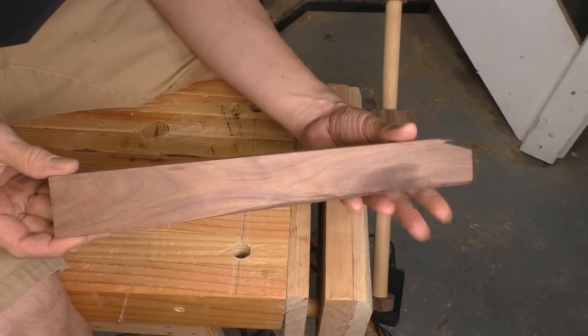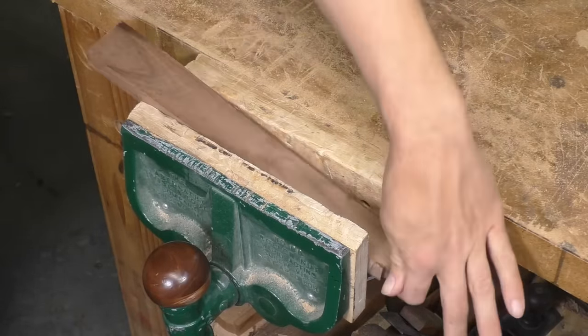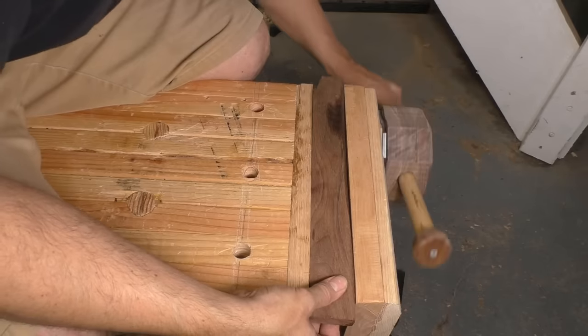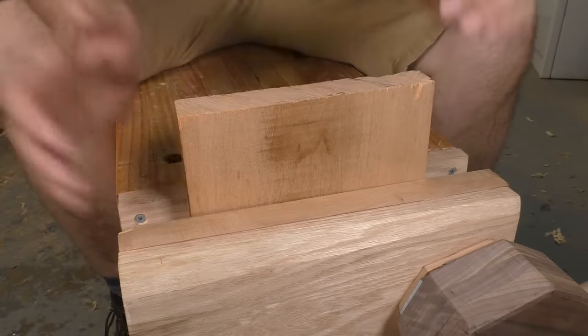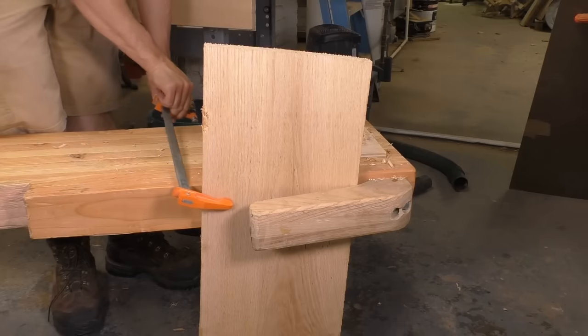You've also got to understand that this vise will always have some tendency to rack — the jaws are always going to want to be a little bit out of parallel. This isn't a problem and it can actually be an advantage. For instance, if I have a tapered board that's thin on one end and thick on the other, it's tough to take that to my cast iron vise because that vise is so rigidly parallel it really can't deal with tapered or out-of-square pieces. But if I bring that same piece to my wooden English pattern face vise, I can put the thick end by the guide bar and the skinny end by the screw — when I tighten the vise, it naturally racks around that piece, covers all the surfaces, and holds the board very solidly. This face vise design also gives us up to nine inches between the guide bar and the screw, which is perfect for working on the ends of wide boards.